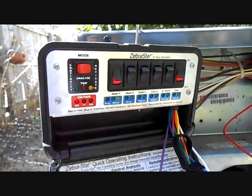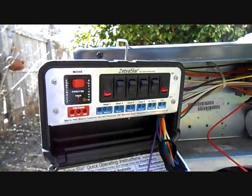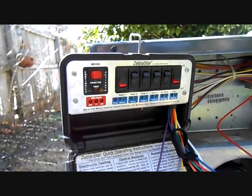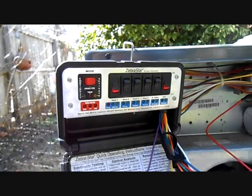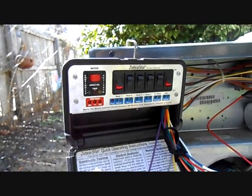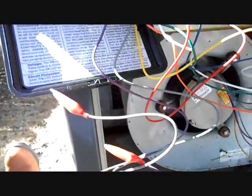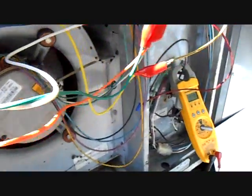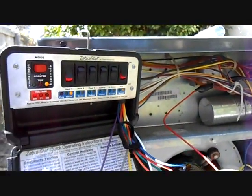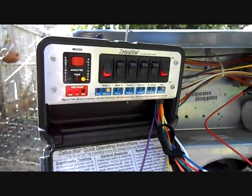On days like last night when it was 25 degrees or a little bit less outside, the heat pump alone is not going to cut it — it just doesn't have enough BTU output at that temperature. This is a two-ton machine, probably putting out like a ton or a little bit less than a ton of heat at that temperature. So it needs the heat strips to keep up, but they just weren't there — mystery solved. We'll put everything back together and make sure everything else is coming on. Another victory for the Zebra stat.